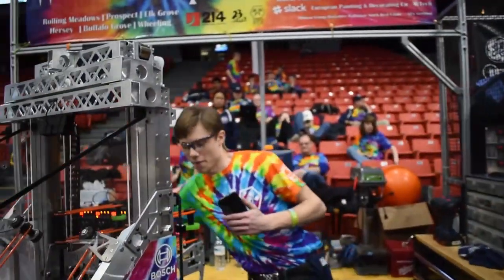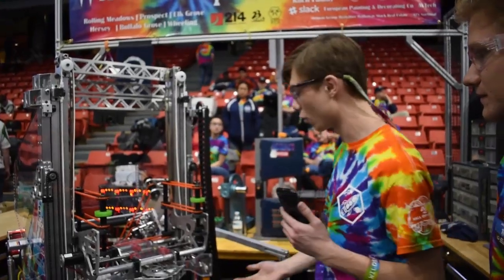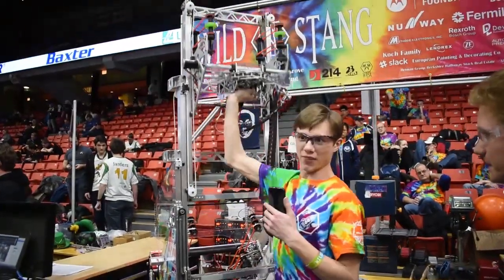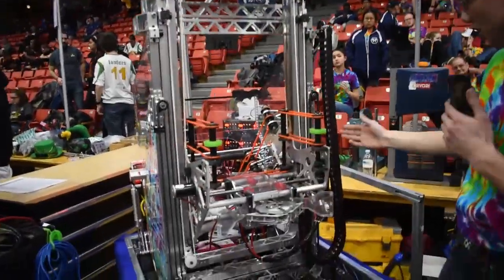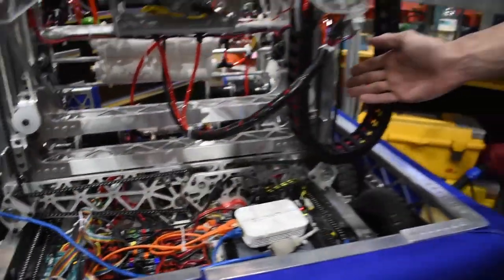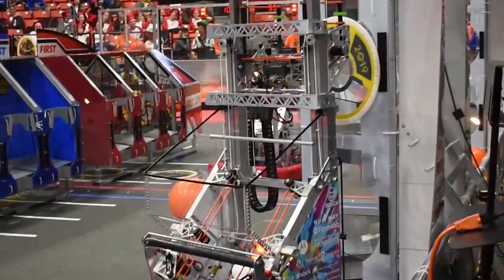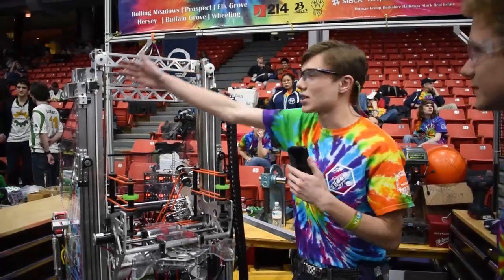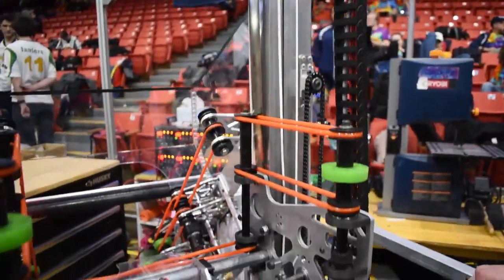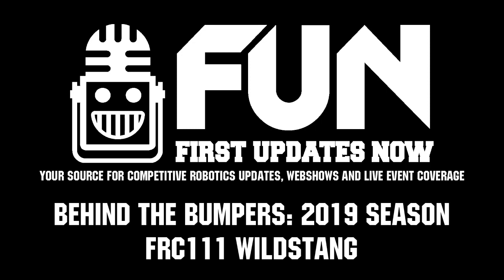So this is our lift — it's a three-stage cascading lift, so everything moves in one motion. As the carriage goes up and down you can see the stages move with it in one motion. The first stage is driven by our gearbox under here — it's two 775 motors with a custom designed gearbox. We have chains that run out to either end of it; the chains hook onto the bottom stage and raise the whole lift up, and that cascading motion makes it one movement. We also have constant force springs so the gearbox doesn't have as much force to lift the whole lift up, so we're not going to be blowing up our lift motors. Thank you guys very much, you have quite an awesome robot — good luck this weekend!